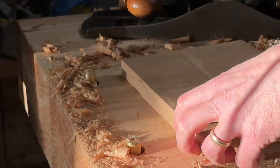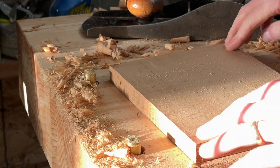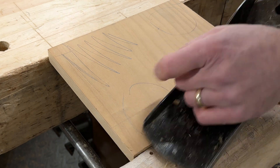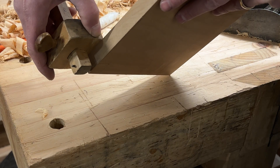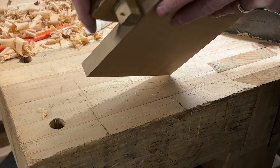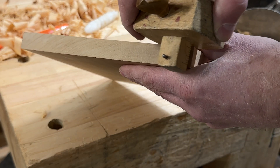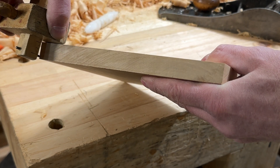I'm working here on the camera base. Everything is going to be hanging on this board, so it's got to be nice and flat. What I'm doing here is making sure one side is flat and then I scribe that face, and I'll cut the other side down to that line. That'll give me a consistent thickness.